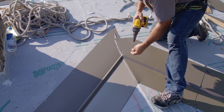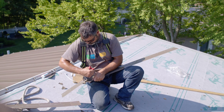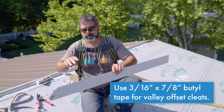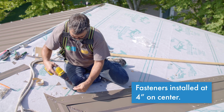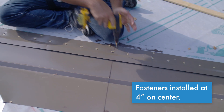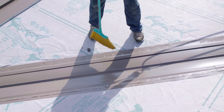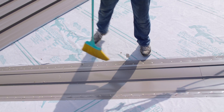Because the ridge flashing is going to cover this section of valley, Matt can put a few extra screws in the lap. Next up is installing the offset cleats — put some butyl tape on that and seal it down. Just doing some maintenance on the valley, keep it clean. Don't step in it, don't sweep metal shavings down it.